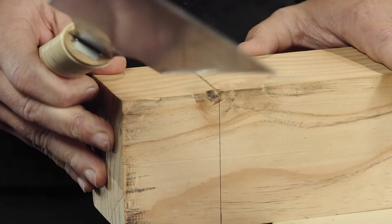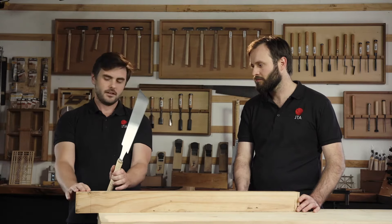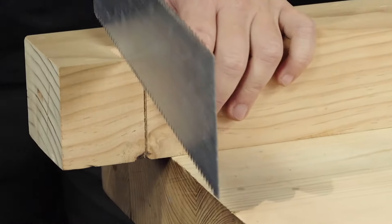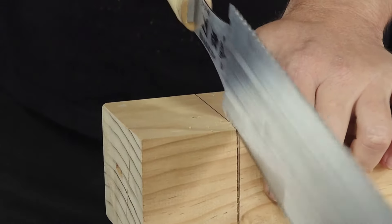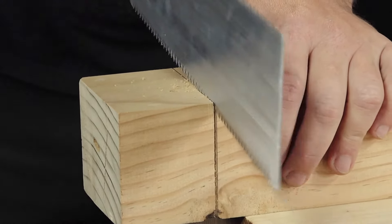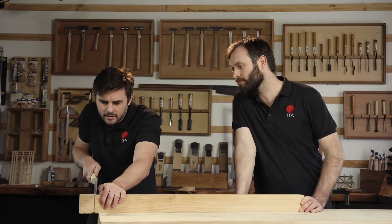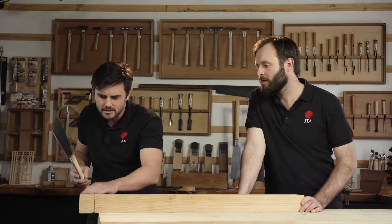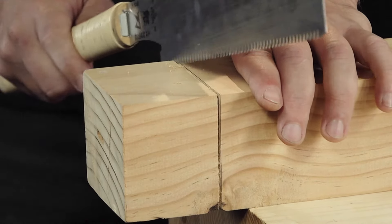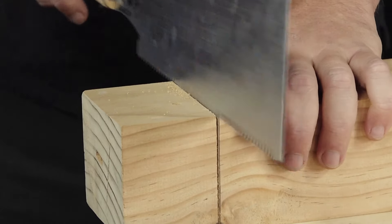So there we have it — that's the first cut ready to go. Now from here I'm going to take the cut down the close side to me and get it down to about halfway through the wood. Then I'll roll it over and do the same thing again, bringing it from here down to here, keeping it on the line, starting off with small strokes and then slowly making them longer. It's really crucial that you take care in this phase of the process. Getting this straight is going to make your cut straight — get this right and everything else should fall into place. Using my thumb as a guide again, same principle as before, joining up the line to make a kerf that goes all the way from one end of the piece to the other.